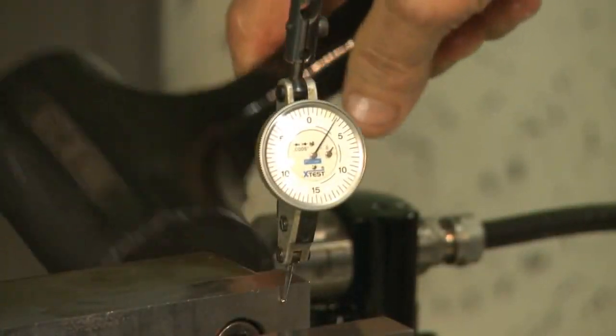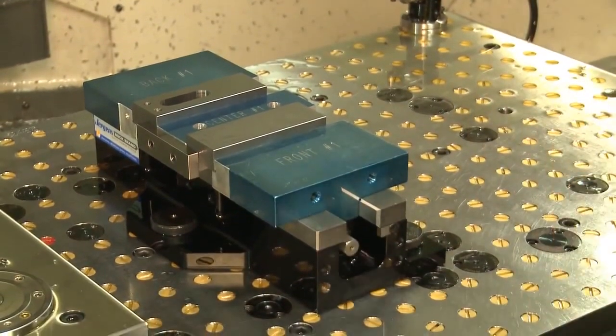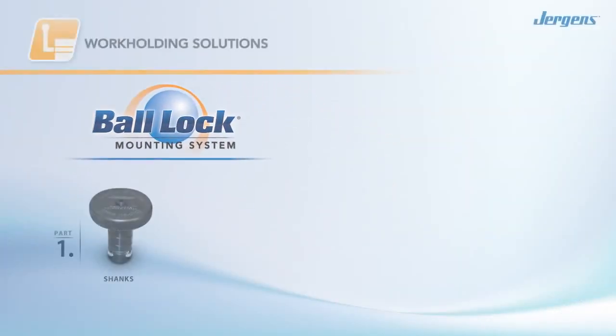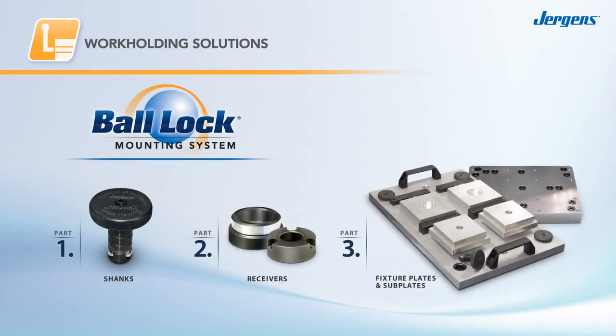We compared the time it takes to complete the same setup using 2 work holding methods: manually indicated locating and mounting, and Jergens ball lock system. Ball lock is the industry's original quick change fixturing system, using shanks, receivers, fixture plates, and subplates to quickly and accurately locate fixtures to machine tables.